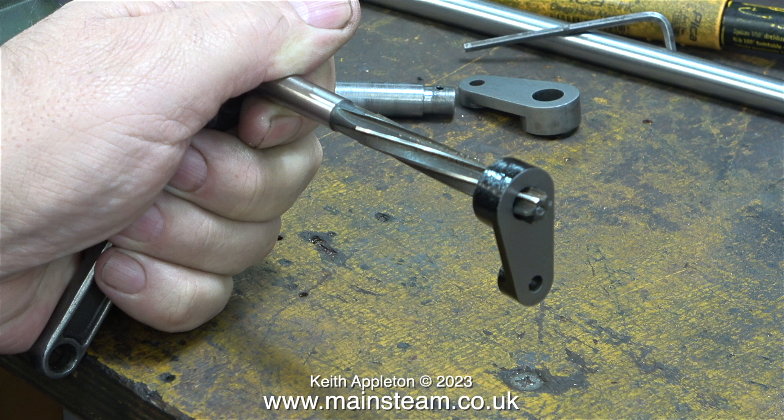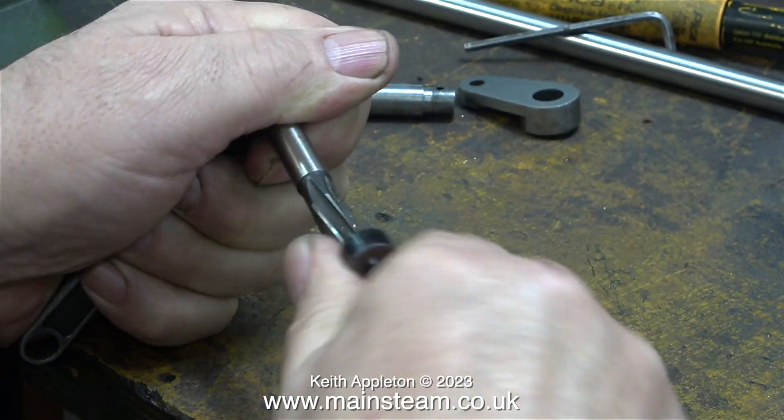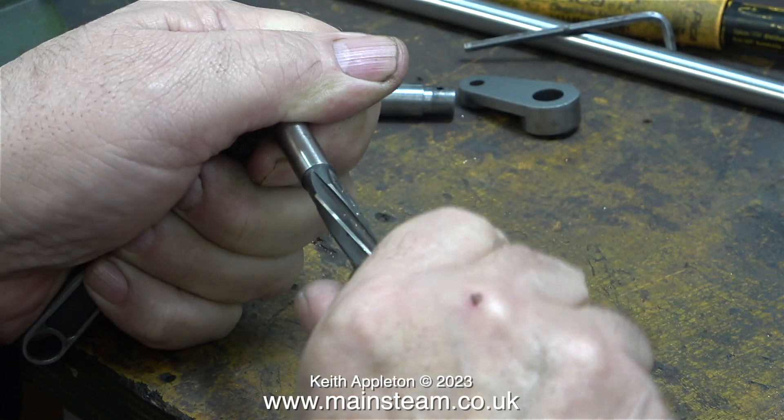Before I start making the crankshaft I'm going to check the crank webs, and to do this I'm using a hand reamer. Hand reamers are slightly tapered but very soon they become parallel. I'm finding with this crank web — one of the originals from the pre-machine kit — that it's okay on the end of the reamer but as I rotate it it stiffens up slightly. Not only is the hole ever so slightly too small, it's also ever so slightly tapered. The crankshaft I'm about to make will not be tapered; it will be parallel. So very gently I'm winding the crank web down the rest of the reamer.